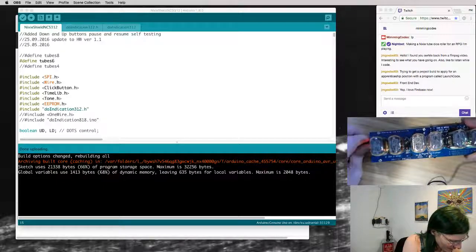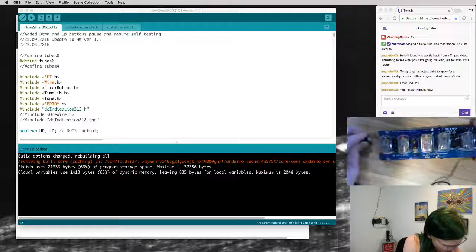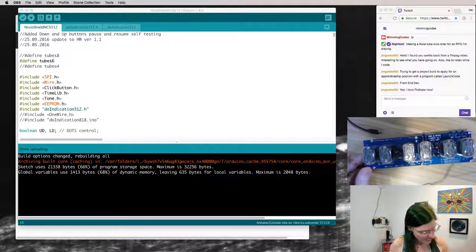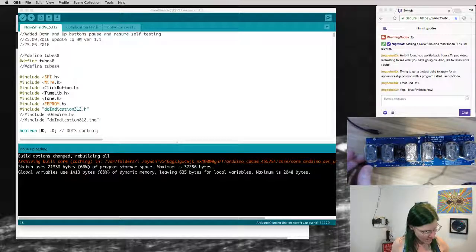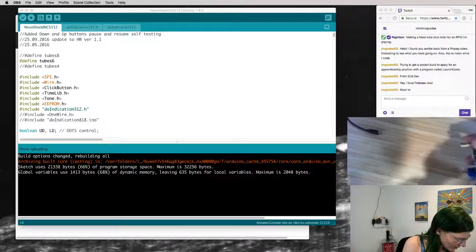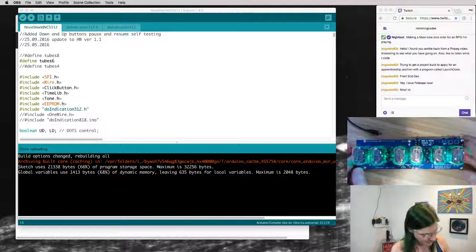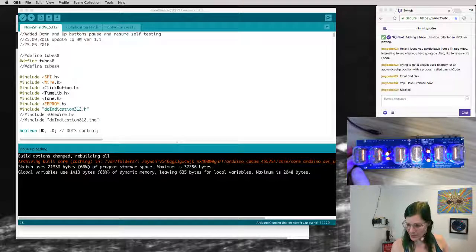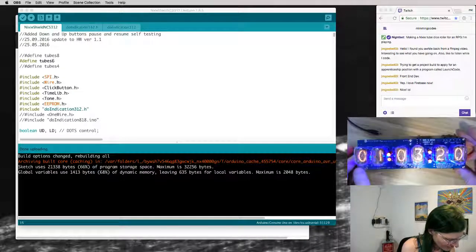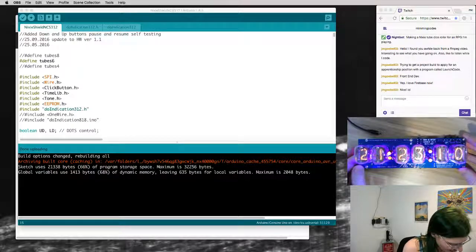So rather than just add a power supply while it's running, I'm going to unplug it from the micro USB and plug it straight into power, because I imagine the Nixie tubes require an actual power supply. Oh, my little board's off. But the Metros have a little on-off switch on them, and the Nixie tubes have lit up. So there's backlight LEDs. Now it's going through a count sequence. One of the tubes is a little bit flaky. Like one of the numbers didn't just show up. The 3. So that's okay, because new tubes are not actually very expensive.